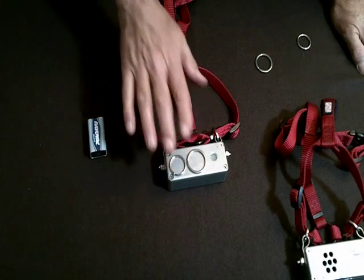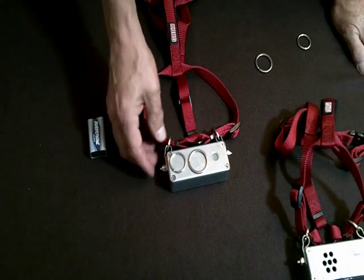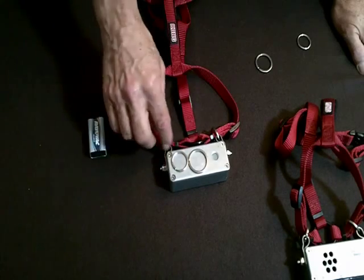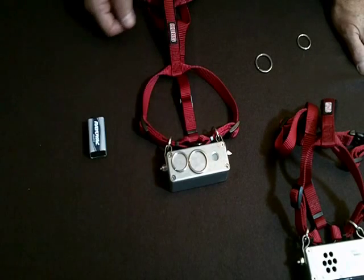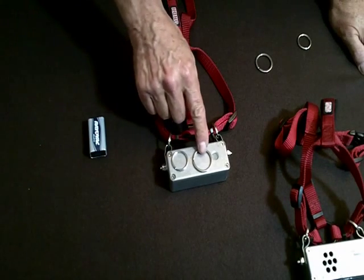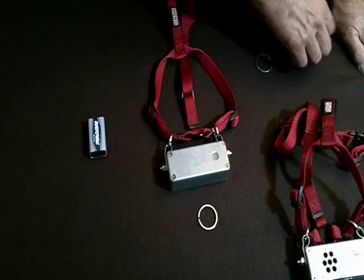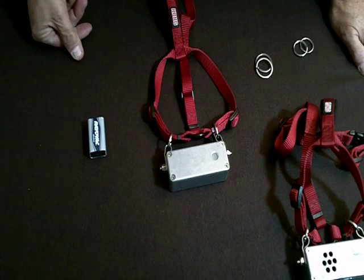We're having a little trouble — some of the suppliers sent us rings and when they got here, they were nickel-plated, not stainless steel. Everything else on the outside that we supply here is all stainless steel: the screws, the nuts, the clips, all of it. The box itself is ZAMAC aluminum alloy and everything else is stainless steel for corrosion compatibility. Some suppliers, when we said 'this isn't stainless steel,' they said 'it doesn't corrode, it's stainless steel.' No — stainless steel is stainless steel. Anything else is a plating. We don't want plating; we want real stainless steel.